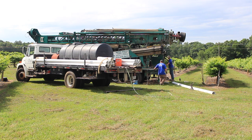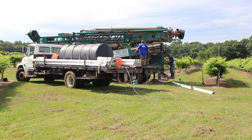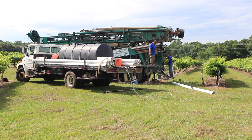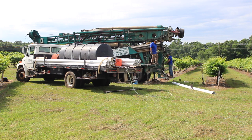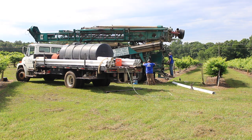One of the most common issues we find when setting up to drill a new well is people will dig out a dirt bank and ask if we can get the well as far back on that bank as possible. The answer is no. The reason why is — if you see where this outrigger is going down on the jack box, that is about where the well will be when it's finished, straight in line with the drill rig. From that outrigger back to behind where I'm standing, where the platform is, is probably another six or seven feet.